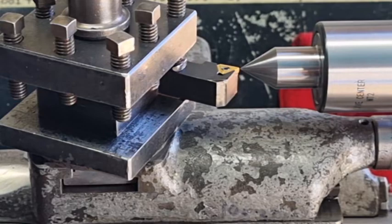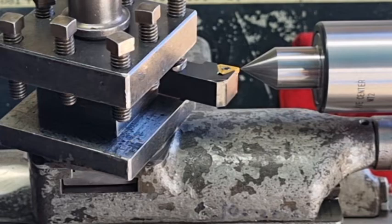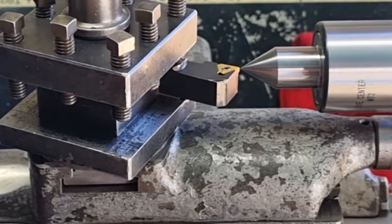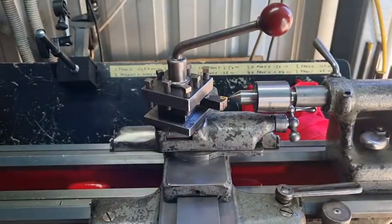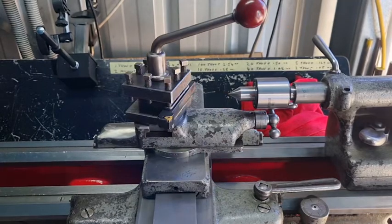We need to put the chuck back on and look at the next method to make sure you've got the right height. If we measure from the bed to the center height, that is the height we need to record. You can either use a caliper to check, or you can machine off a piece of bar stock — say half an inch or one inch in diameter — sit that on the compound and bring it up to the height of the tool. We'll measure the height and I'll show you the tool I created for this method.